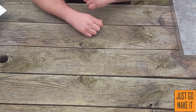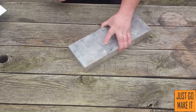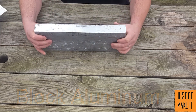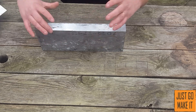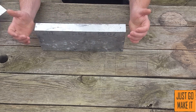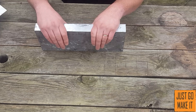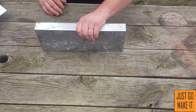I'll be going from worst to best. One I would not use is block or billet aluminum. This is an aluminum that is probably rolled out in two dimensions cold in gigantic presses. I would not use this — your casting would probably not turn out very well and would end up being a very soft casting in the end.